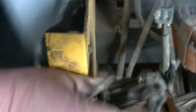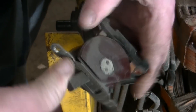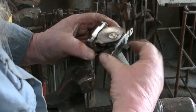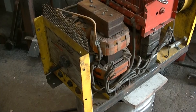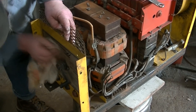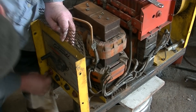We'll spray it out with some electrical cleaner, get a little bit of lube in there, and hope for the best. So why a TIG welder in the shop? We have a MIG welder, and this thing will double as a TIG and an arc. We've got restoration work to do and I wanted a scratch start TIG to put some Damascus billets together. If you don't weld them with a MIG welder you don't have to worry about inclusion of the mild steel wire - there's no filler wire with the TIG.